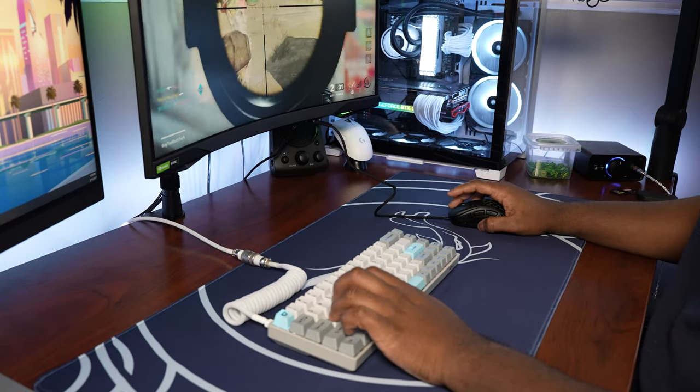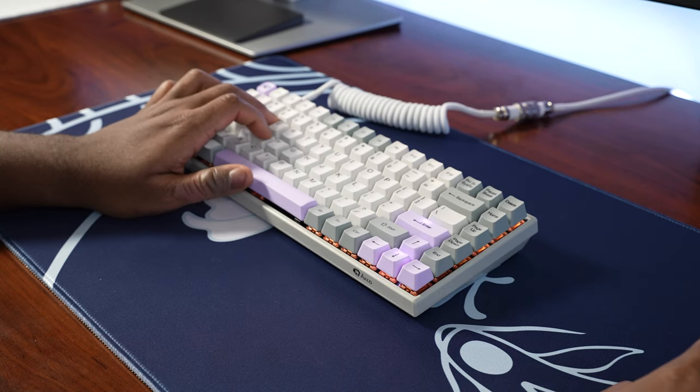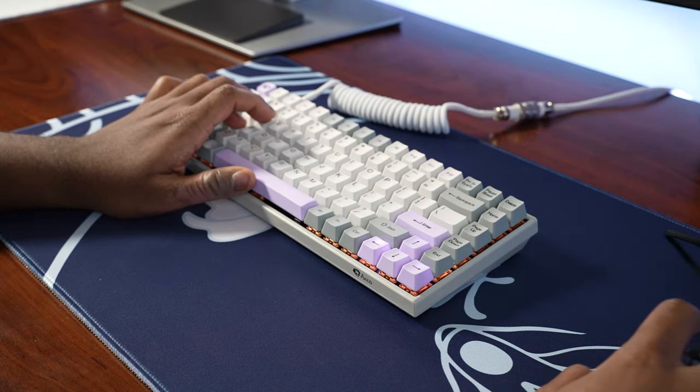Some differences between the Gateron Oranges and the Akko Oranges: the Akko Orange switches actuate at 1.9 millimeters with a 45-gram actuation force, while the Gateron Oranges activate at 2 millimeters with a 55-gram actuation force — not really that different, but they both sound very different. Before the typing test, I want to say the stabilizers on both are okay — not the best I've heard. I do wish this board was hot-swap so I could pop the stabilizers out and band-aid mod and lube them. The Akko Orange actually sounds a little bit deeper in pitch, while the Gateron Orange sounds a bit higher pitched. Let me know which of these two switches you guys like best.